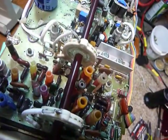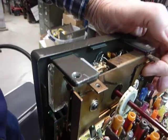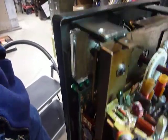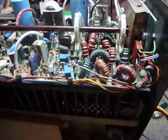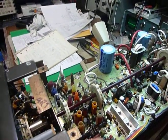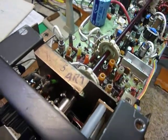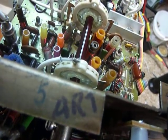When aligning the band switch — if you have to take this final assembly off — you have some adjustment where this will slide up and down. Loosen this screw and this screw and you can slide it up and down to help align things for the coupling right in here. There are similar adjustments on the back when you put it together. I stick the shaft into the coupling, then move this up and down until the shaft is nice and loose in there — then I know it's centered — and then tighten the screws.